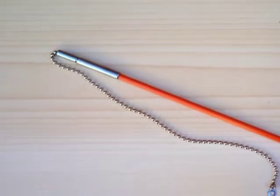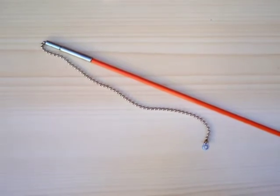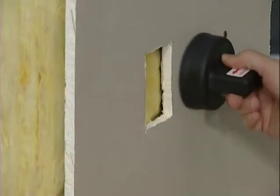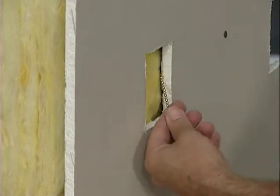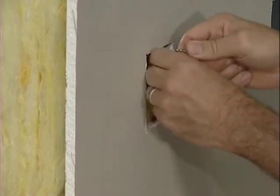To go up an insulated wall from below, you may be able to use a short length of ball chain attached to the end of a fiberglass rod. Have your buddy below push the rod up just past the height of the hole, then simply work the paddle magnet around the area where the rod should be and it will grab the chain. Then slowly work the chain over to the opening. Works great!